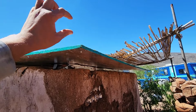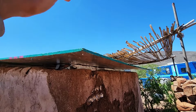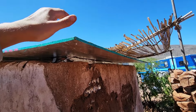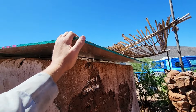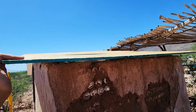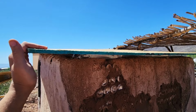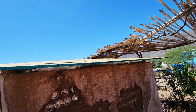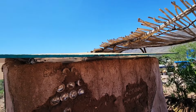We're gonna put our framing out on top of this, and then our foam, and then another sheet of plywood. So it's kind of acting like a false roof, I guess, that is securely nailed down to our previous roof. It's a weird retrofit. Everything out here is just very much figuring things out as you go and making it work. That's my whole world.